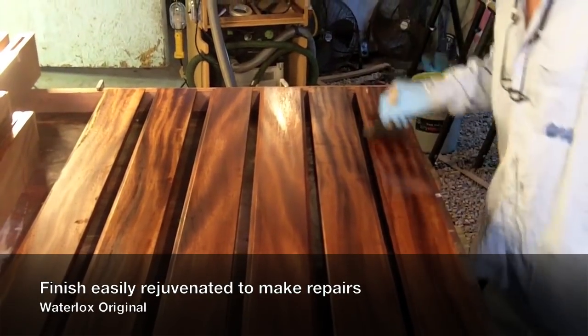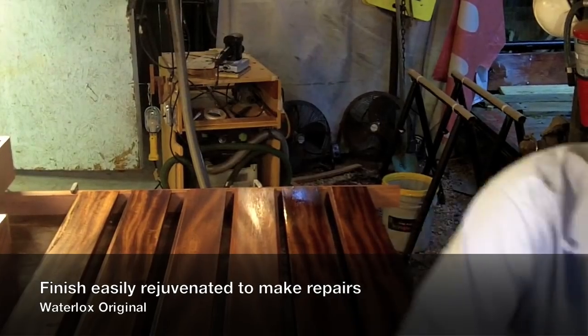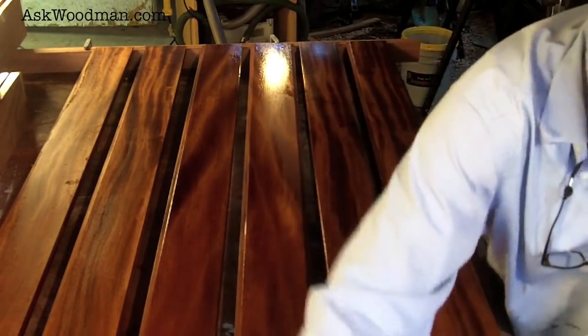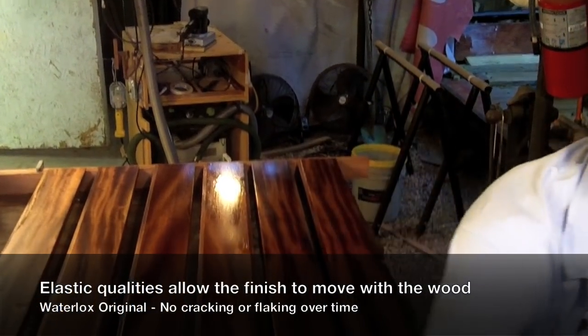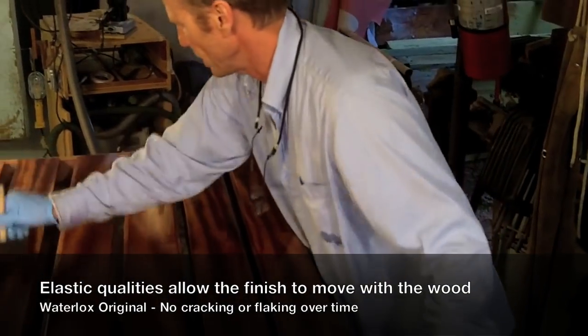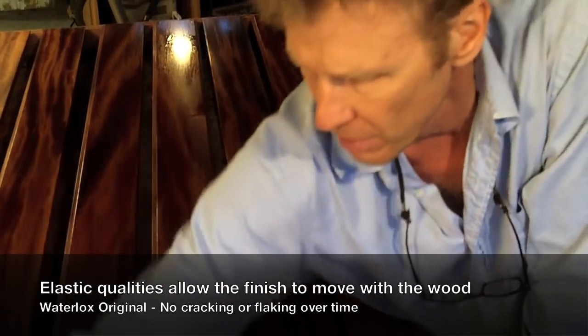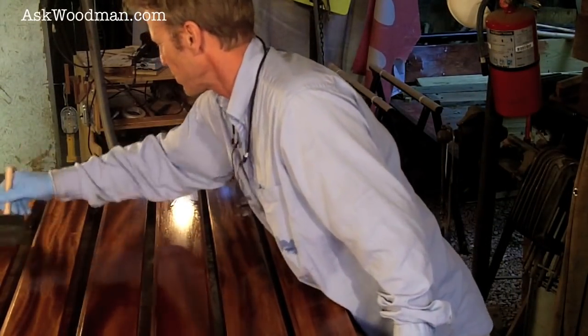And if you have to come back and get a glass ring out of the finish on somebody's piece of furniture, lightly scratch it, apply your coat again, and it just disappears. Little scratches just disappear. It makes you look good. The other good thing is that this finish stays elastic almost indefinitely, so as the wood expands and contracts, this finish moves with it — unlike poly, which becomes rigid plastic. That's why when poly starts failing, it'll start flaking off and getting a crackled appearance, because the finish is so inelastic it can't move with the moving wood.